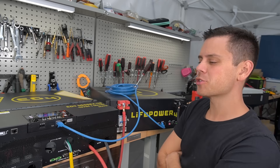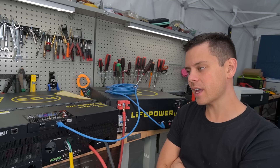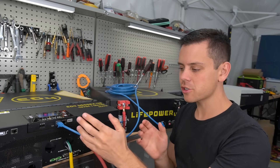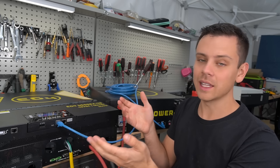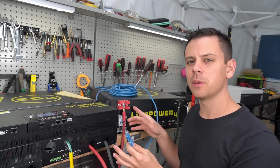Fast-forwarding to the next day — I'm trying to get the communication system to work because it's supposed to be plug and play. But I realized I can't clear the error because I'm using a standard ethernet cable. You have to use the special cable that comes with the battery — it does not come with the all-in-one unit. I will have these batteries in the future and we'll make a video with a step-by-step tutorial. Their other inverter worked flawlessly with the new EG4 protocol, so it should work just fine — but you need the proper cable. Do not try to use other cables or ethernet cables. It will not work.